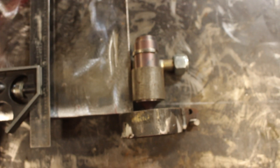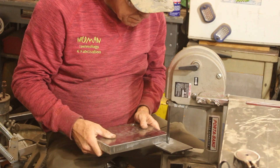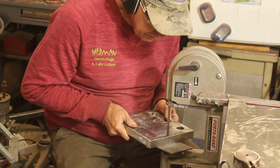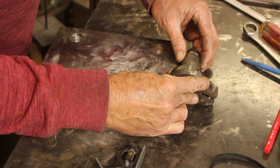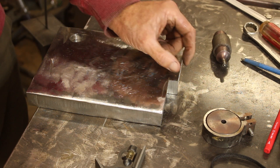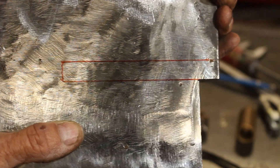Looking at this, we've got our guide tube for the punch and our bracket to hold the die. We're going to want to come in here and remove a portion of this — I'll mark that and cut some of it out. That alignment is looking pretty good. Next we're going to want a relief slot in there so we can stick our piece of steel in and we're not trapped punching only near the edge. We'll cut that out and that'll be more than enough.